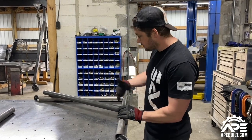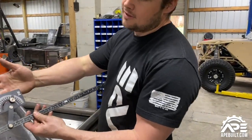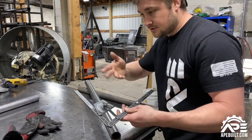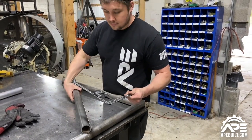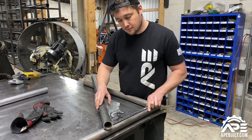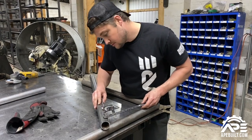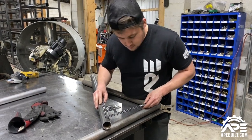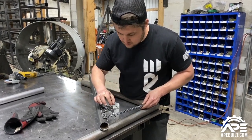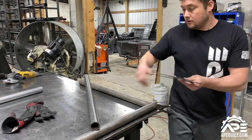We're going to set it right here at a random angle. We'll come over and get our angle finder — I like this one, which I probably use most in the shop. I got it from tricktools.com. First thing you want to do is find the angle on what you're cutting. I like to use both hands and set it right there, then pull it back. This one looks pretty square — I'll tighten up the dial.